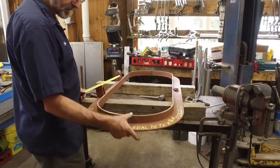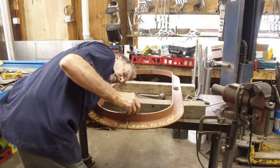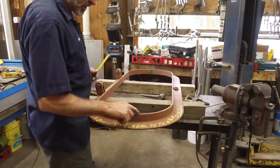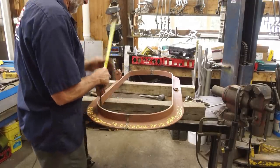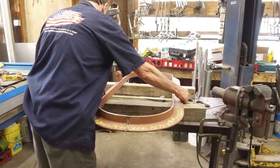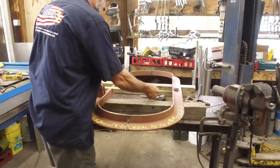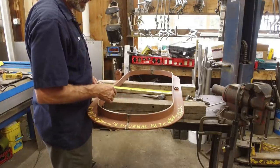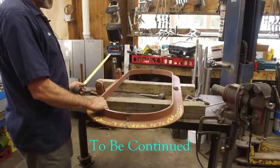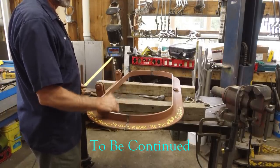When you sight this thing off the end it almost looks like this end is narrower than it is in here, but I think it's just the way it angles — it's the same dimension. It curves around here and the chalk line looks light on both sides, but regardless our main objective was to make the mean width 24 inches, and from outside to outside we've made that 24 inches. That's basically an 18-inch hole or walkthrough access. Now we can set this off to the side, get the hatch up here, get it marked, and cut it into two halves to weld back together just like this.